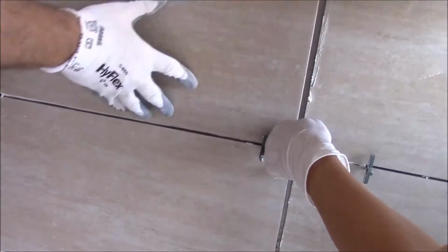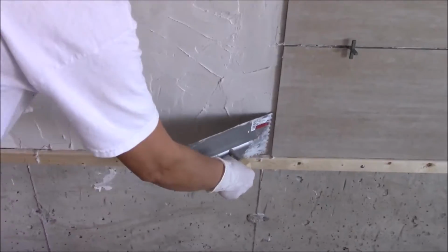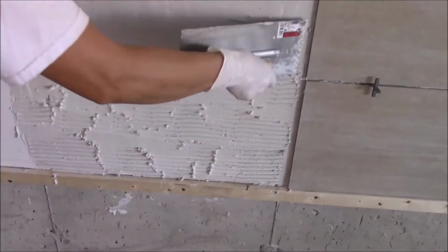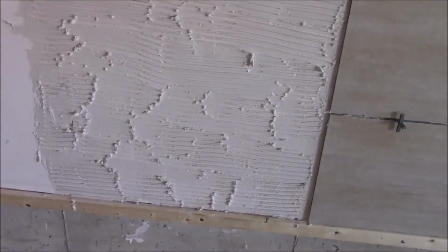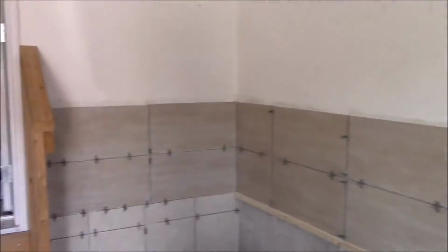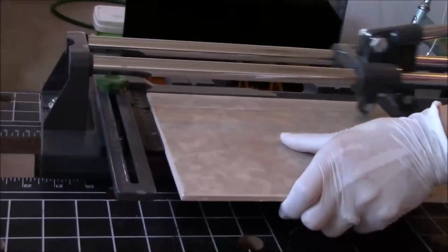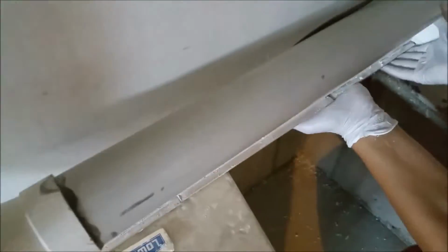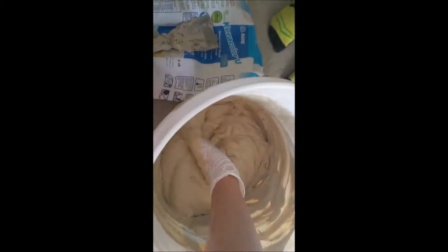It is important that the entire tile be evenly covered with mortar. This means the depth of mortar on your tile should not exceed the depth of your trowel notch. Make sure that the corners of the tile are properly covered with mortar. When all the tile work is complete, allow the tiles to dry in place for several days before grouting.